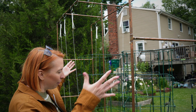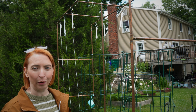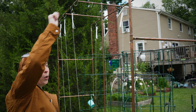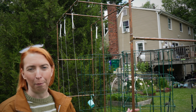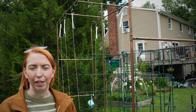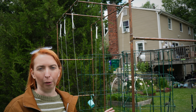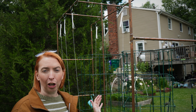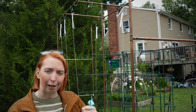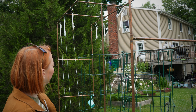So we adjusted and attached those side pieces to be perfectly aligned with each other and with the bed. Then we put the top piece in and basically soldered it in place. One thing we didn't show you in detail was how we did the middle brace, because you will need a middle brace for such a large bed, and probably for most beds once you go a little longer distance, to have it supported in the middle, especially when you put a weight on it.